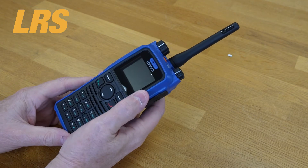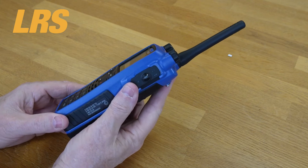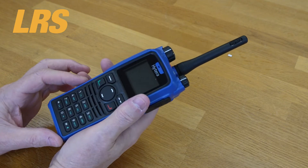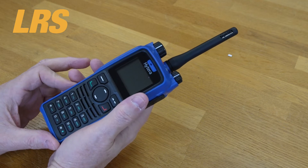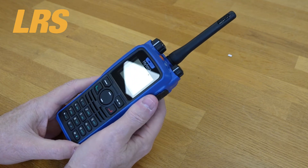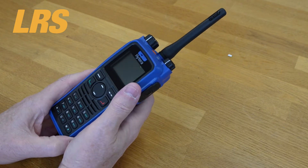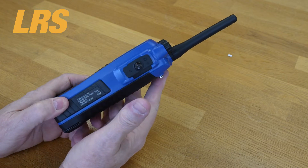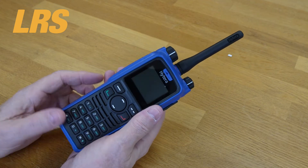This is an ergonomic product design. Even in low light situations the PD795EX display is easy to see — it's a pretty big display. The big keys and non-slip surface on both radio models ensure reliable and safe operation even when wearing gloves. Both models are dust proof and waterproof, compliant with protection class IP67, able to withstand water depth of one meter for at least half an hour.